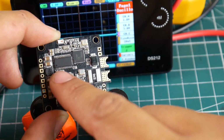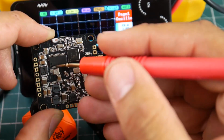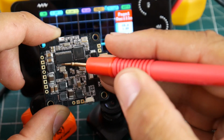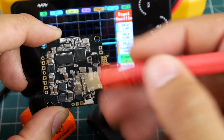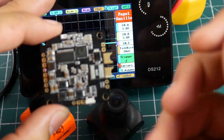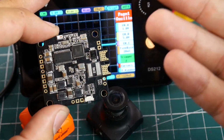And pin number 3 on the bottom here with the little dot, if you count the third pin from there, that's the 5 volt. So you would have to actually take your multimeter and just check the voltage. Go to pin number 3 with your positive lead, and with the black one, go to ground and see if it's receiving 5 volt. If it's not, then it's not receiving power. That means possibly your OSD chip is still fine. It's just an issue with the 5-volt regulator on board, or just the route to your OSD chip, depending on the hardware.